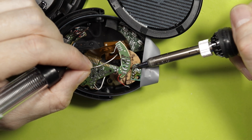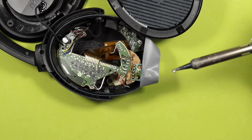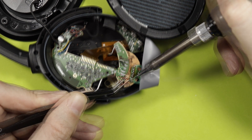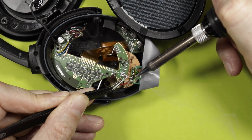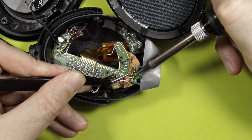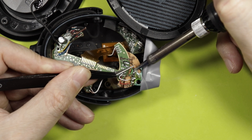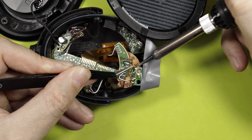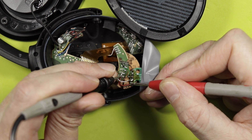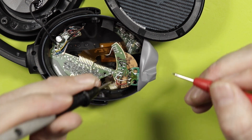This procedure will make my work easier when I solder the wires onto those points. I'm going to start by soldering the red wire, then the white one, the green one, then skip one and solder the black one — which is the ground — into the grounding trace. Now I'm going to check for continuity in the current flow, and everything works well. The soldering has been successful.